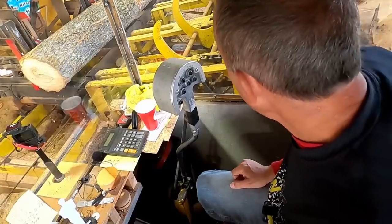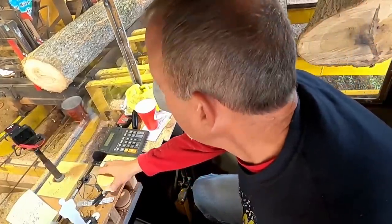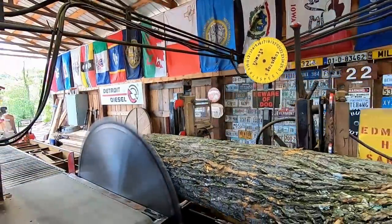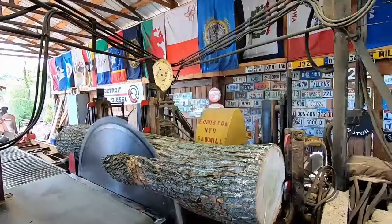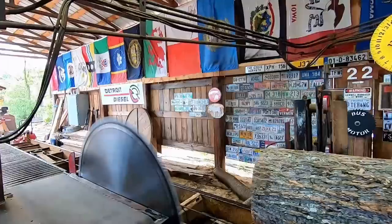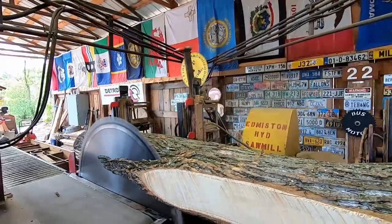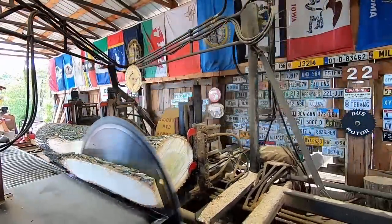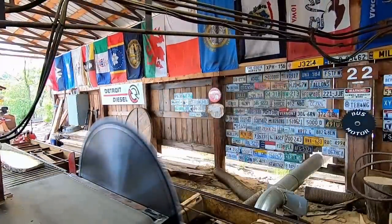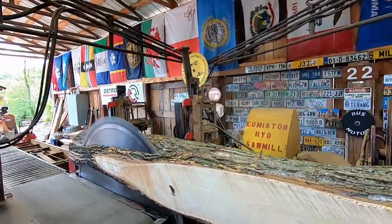Let's just pump it forward here, we'll get rid of that crook. Let's get going and take these off in small bites. That would make a nice plaque there. We're going to get a flat spot established. I do love sawing poplar. I'm feeding it slow right now because we're only held by two dogs.